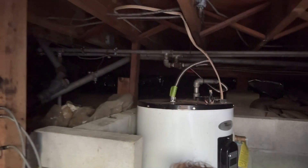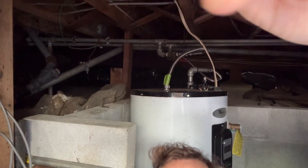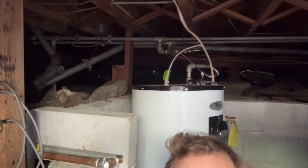The other thing you want to look for is evidence of rodent activity. You can see this house does not have flooring insulation. Also, you see the piping — it's metal, it's galvanized. This is old galvanized piping. Galvanized piping is how they used to plumb houses. It's good, it's dirty, but it will eventually rust, leak, and cause a problem.